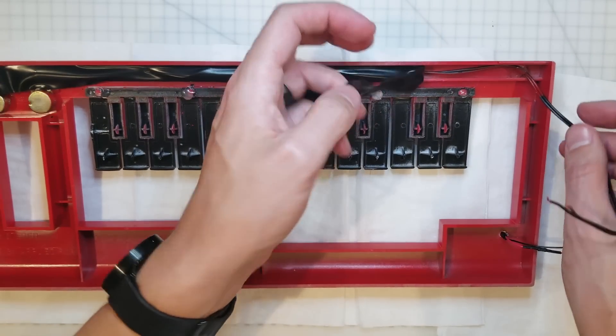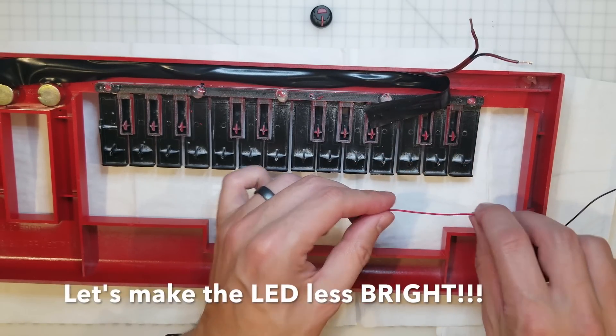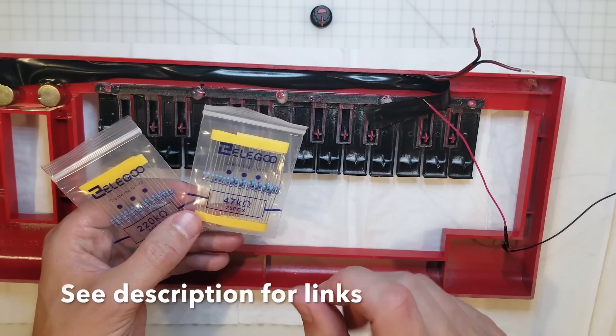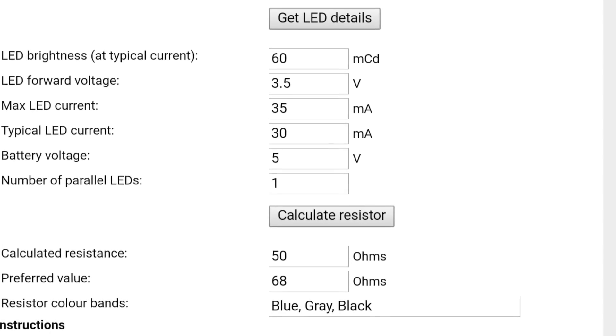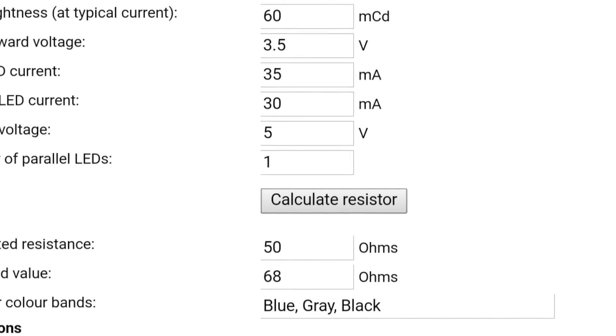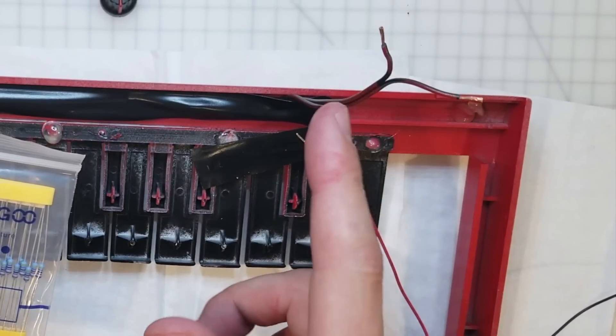Let me reveal my handiwork here a little bit. It doesn't matter that we already have a resistor on there — you can put them in series. If you go to this website, it's actually a calculator that'll tell you what kind of resistor you should put in a circuit if you're trying to drop down the power. This is a 3.5 volt LED and this is a 5 volt power supply.